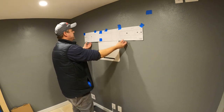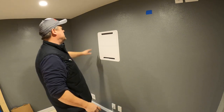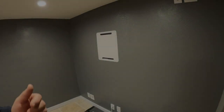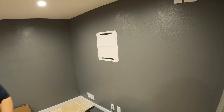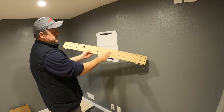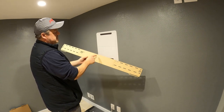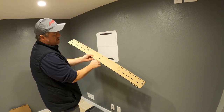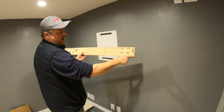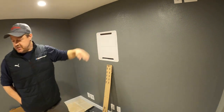We're not leaving any of these measurements up. The next part is using Install Template Co. We know our measurement — the customer wanted to come down that much from the ceiling — so we used the paper template. Now let's see how fast we can do it with this prototype template from Install Template Co. They're telling us: left wing, center wing, right wing. A decal will mark our top and bottom heights so you don't have to refer back to the Samsung manual. There's a slot and center indication mark, plus placement marks for the wings — that's actually where your TV wings drop down.